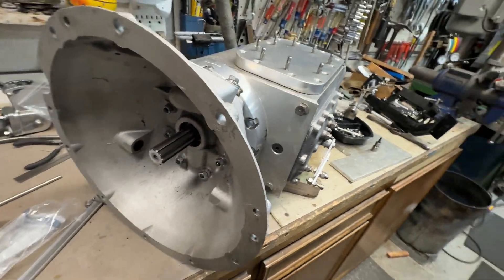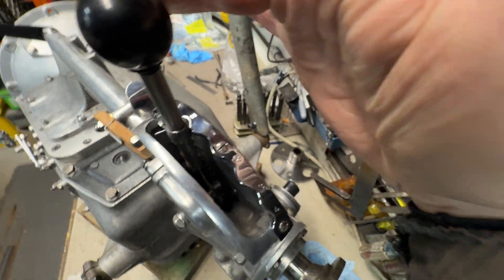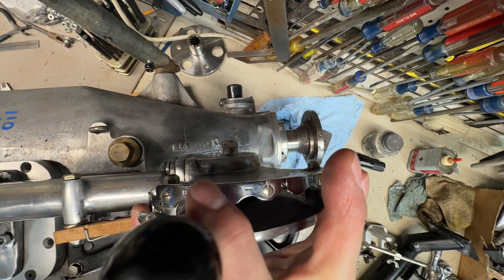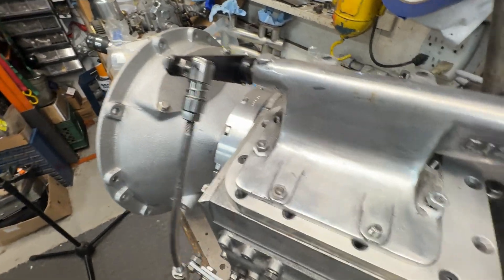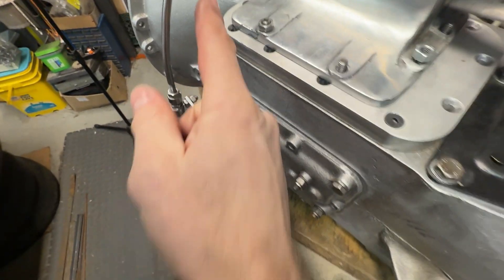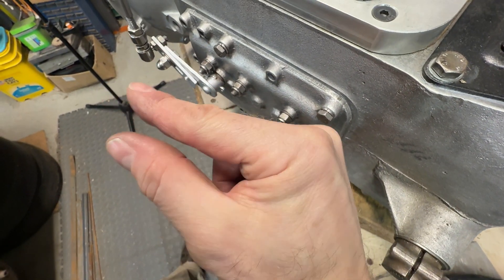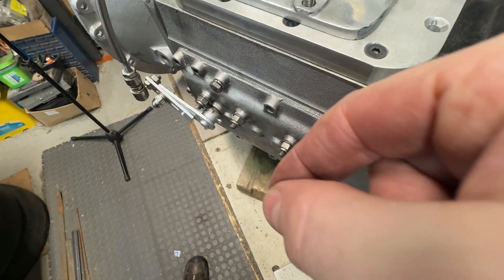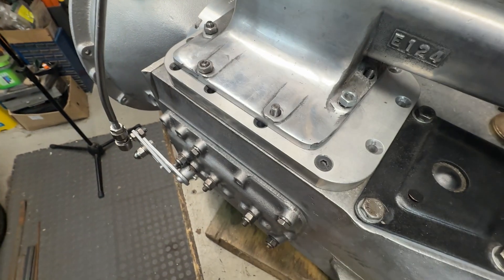You can see it fits very well. Here's what the setup looks like with the remote selector. This gives you the gears — we have reverse, which has a lockout to prevent you from grabbing that at speed, then neutral, first, second, third, fourth. There's a little bevel gear in here that turns a shaft, and we're just moving this sector arm up and down, translating to motion in this. It drives another bevel gear that rolls a cam over, and that cam has flat spots cut out. Whenever a flat spot gets in front of the right little spring, that spring sticks out and pushes against the actuating strut, and that strut is what grabs the brake band of the gear you selected.